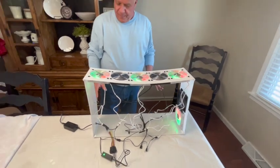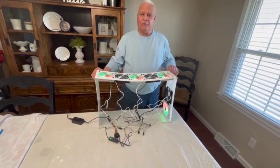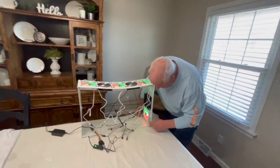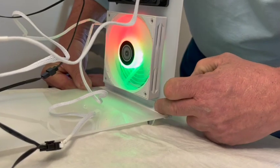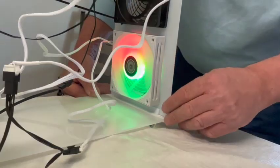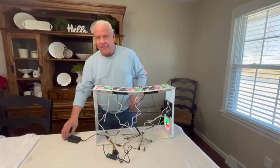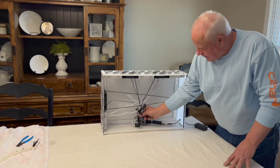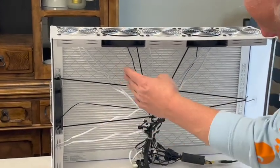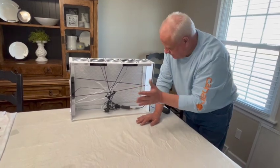So now we're going to take our foam — the foam will only be applied on the side panels, about a quarter inch in. If your filter doesn't seem like it's fitting just right, there's a cutout on these corner strips. Your filter should go up and hit that. Sometimes people have gotten the filter on top of it and then they see a big gap in there. But once you get it situated in here with your foam, we'll show you here in just a second. As you can see, we've bundled our wires up with our zip ties. You want to pull all your cords so there's enough slack that they won't get caught in the fans no matter what position it gets put in.